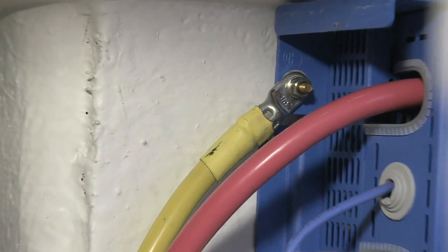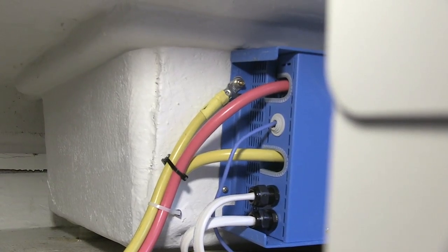In this instance, that's a Class D 250-amp fuse. The last thing commonly missed on the DC side of an inverter is what's called a chassis ground. On a marine installation, the chassis ground must be one wire size smaller than the largest cable feeding the inverter. Most people don't understand why and just put in a 10-gauge wire. It's essential to have the correct size because if you have a DC-side fault — say, from positive to the case — and you only have a 10-gauge chassis ground, that wire will carry all the fault current and effectively act as a fuse itself, which is a serious problem.